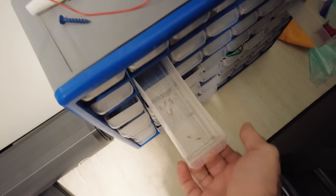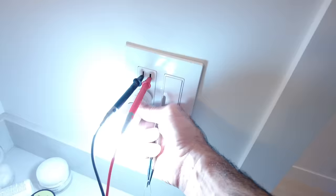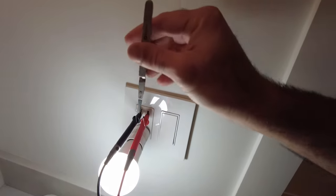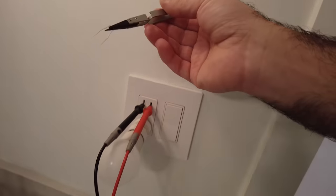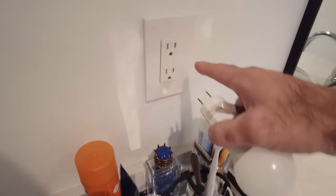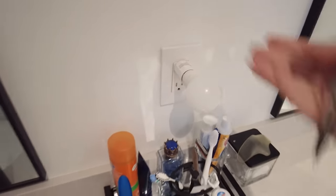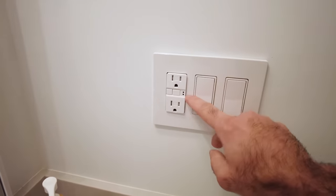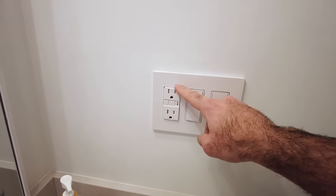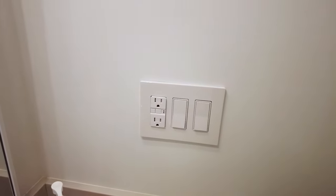Let's make sure we pick the right one this time. Trying again with a 10k resistor — it turned off! So there is a GFCI device on this outlet. Where is it? There is one here. This washroom has a regular outlet, but this one doesn't have power either. It seems one GFCI device can feed multiple outlets.